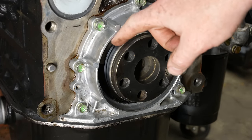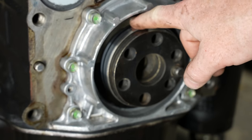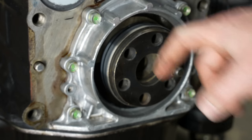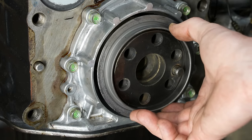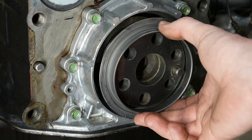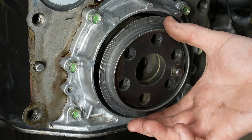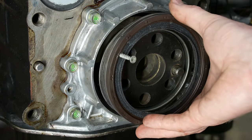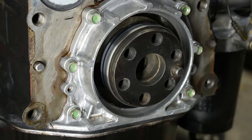Okay, so this ring right here is where my seal rides on. You can replace it if it gets worn out. But if that's not there, which is the more common type, like I was saying, you have to install this wear ring and you have to have a special tool to set it to the right depth to mate with this properly. So fortunately, I don't have to worry about that since I have this style of seal.